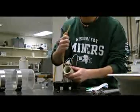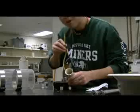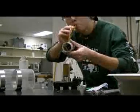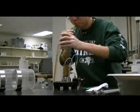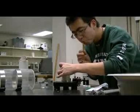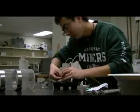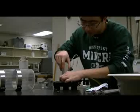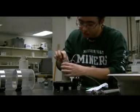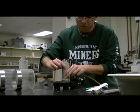However, now I will do it by myself — I call it a man-made vacuum. I will use my mouth to suck it. Then I slide the membrane around the specimen and take off the bottom part of the membrane expander. Don't forget the top cap — put it on the porous stone and flip the membrane up.